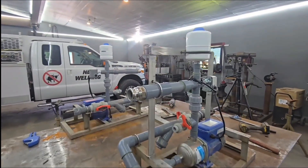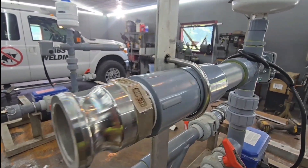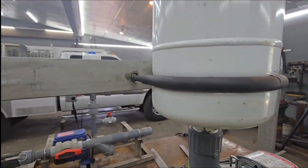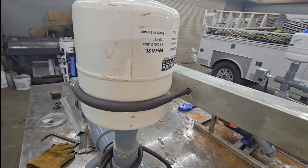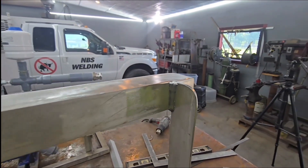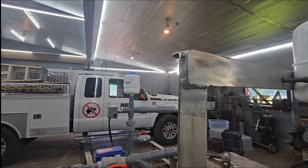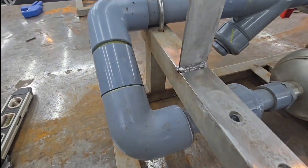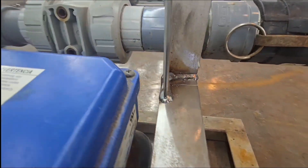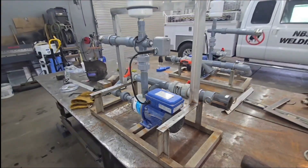I get this welded up and I've got it like I want it with the U-bolts — the U-bolt here is going over that super thick coupling, and right underneath the coupling there's pipe, so that's really thick. Up here the U-bolt has got the vinyl tubing with black heat shrink over top of it. I think that's going to work real good. All of the MIG welding with the ARCaptain MIG 205MP and the ARCaptain stainless wire went really well — I love how that machine welds, and it did really good with the stainless too. I'm really happy with the ARCaptain stainless solid MIG wire.